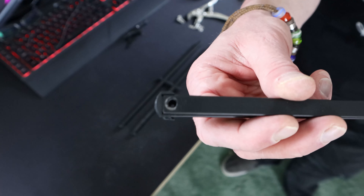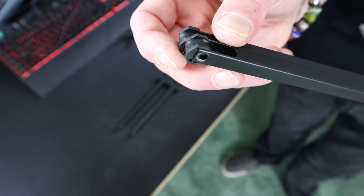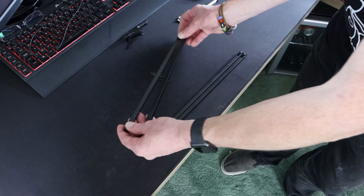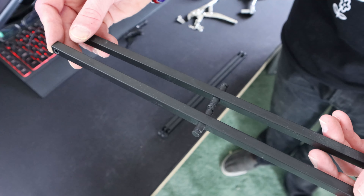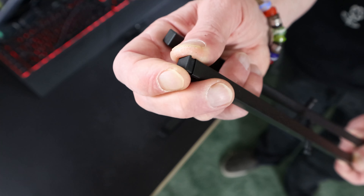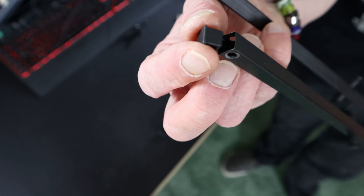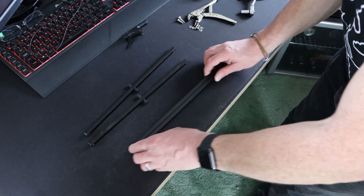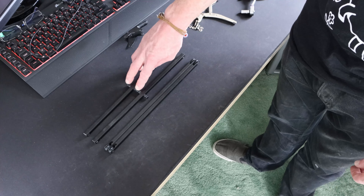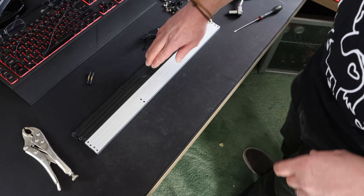Here we can see the four arms — these are around 13 inches or 33 centimeters in length. I'm going to extend these to around 50 centimeters, which will give me a lot longer reach on the actual microphone arm. We can see that two of the arms have these little channels cut out with little end caps — these allow you to run cables through, should you want to. Now this is only 10mm by 10mm so you're not going to get a USB cable through there. I'm going to see if I can get these channels cut out on the new bars, or take these plastic sections out and use them to reinforce the new metal bars. The other two arms have the spring connectors on them, and luckily the spring connector positions are in the same place, so it doesn't matter if I swap top and bottom. These also have end caps to protect the ends and provide stability — they'll stop the arm from crushing together once put back on.